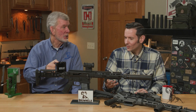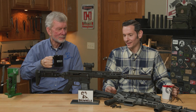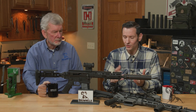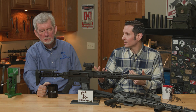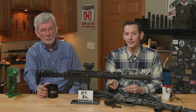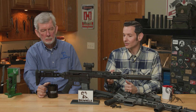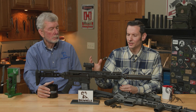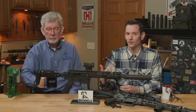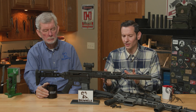He never actually said he saw it happen — he just said it could happen. No one ever sees it happen. So if you buy a nice gun, or you legally have a registered machine gun or whatever, and you think you're prolonging the life of it by putting anti-rotation pins in it — you're not. You're doing absolutely nothing but maybe causing yourself a future malfunction down the road. Because as you get dirt and grit in there, having one less thing able to rotate could potentially cause a malfunction. It's going to decrease your lock time and cause a lot of issues in a standard two-piece trigger.